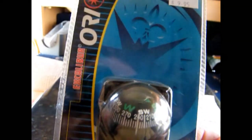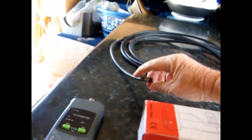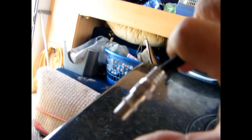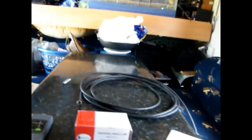Some people use expensive compasses. I just use the $9.95 variety, and we've never missed a satellite yet — so much so we don't even need to take it out of the packet. You'll need satellite quality cable with the fittings already attached, and on the other end is the fitting with a double male joiner. You'll need a few of these double male joiners — they're only about 20 cents each.